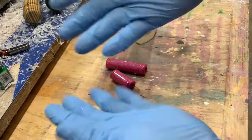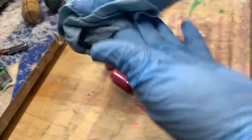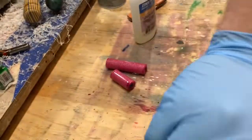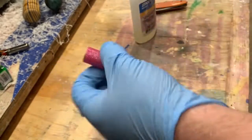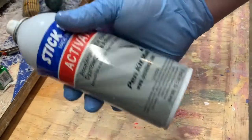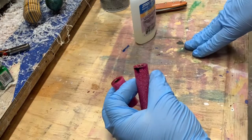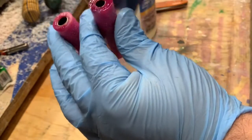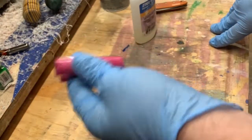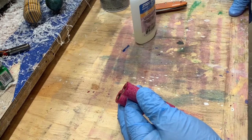Okay, that's recessed in there a little bit. You can see I got glue all over my hands — that's why I protected myself with a pair of gloves. Wipe that off with a paper towel, and I hit the hole outside and inside with the activator. You don't have to do this but I find it a little easier. When I stick it in the toaster oven to cure the super glue I don't have to worry about it sticking. So now I'm going to put this back in the toaster oven for 20 minutes at 150 degrees. If it's not cold in your shop you can just leave it for at least 15 minutes before you mill it, or you could push a tube straight out the bottom with your pen mandrel or pen mill.